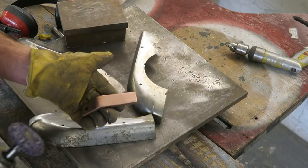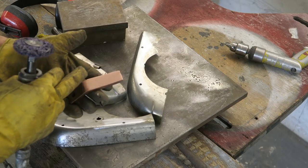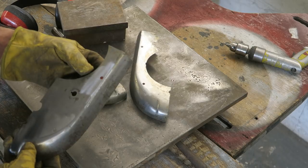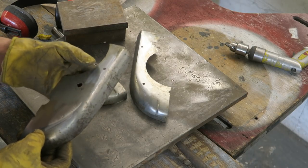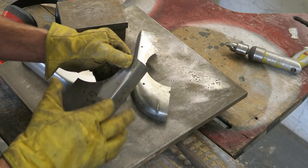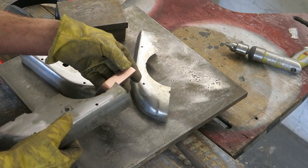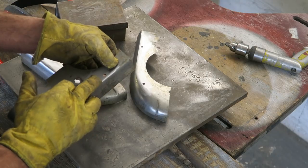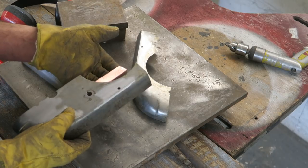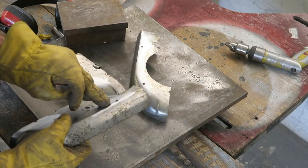top of it. And then when you pull the copper away, the weld is sort of puddled out into the area that you do want it to weld into, i.e. the panel. So, like I say, you have it nice and clean, and then you weld through the hole onto the copper. The copper's nice and clean, it makes good conduction to the welder, it puddles out, and then when it's welded, you grip it up, quickly release it, and then the majority of the heat then stays in the copper, not in the panel itself.